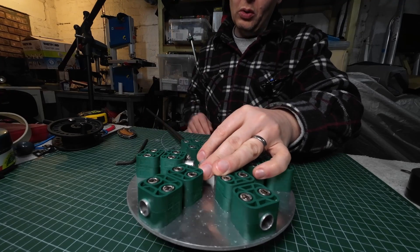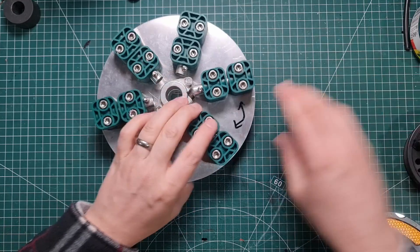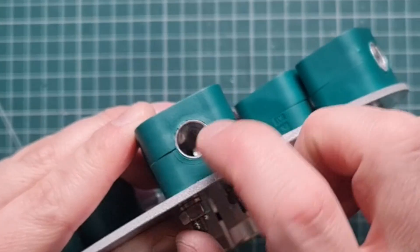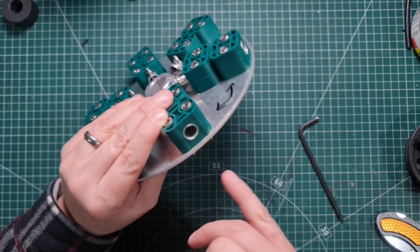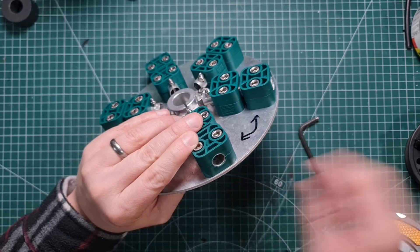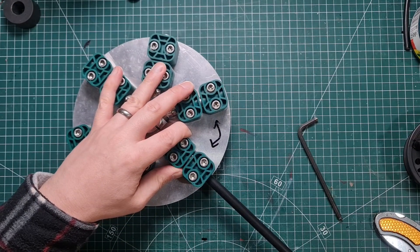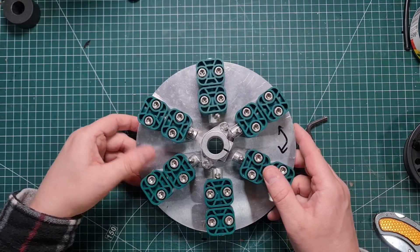You'll find that your pole goes in here very nicely. One thing to note: when I received the aluminium tubes, I had to take a file through the middle because the way they were extruded left a little bit of excess aluminium — almost like a burr. Once I took that off, the pole slipped in nicely with a good fit. And that's our hex beam center plate made.